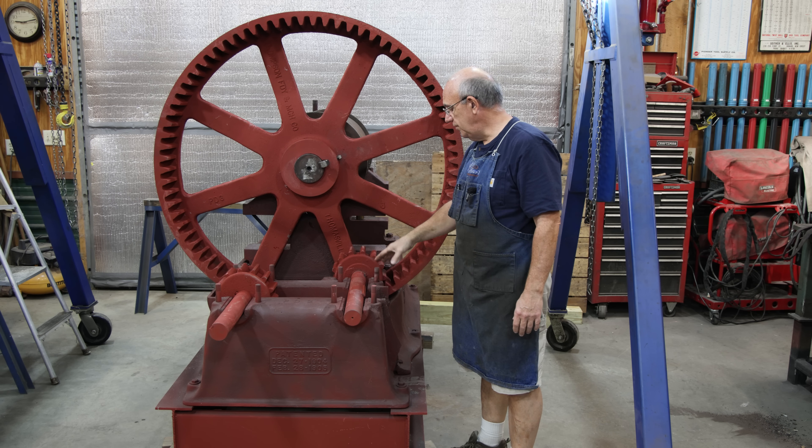I've done some calculations. This big gear has 77 teeth in it; the small gear down here that's driving it has 13 teeth. That's a 5.9 to 1 ratio — you have to turn this shaft 5.9 times to turn this one over here one time. And then you've got a big bull gear on here that has 42 teeth, and this one again has 13 teeth — a 42 to 13 ratio, which simplifies to 3.2 to 1. So you multiply them together and from this shaft to this one over here it's 18.95 to 1 — basically 19 to 1.